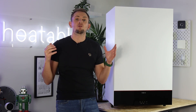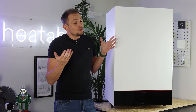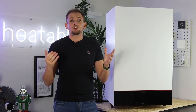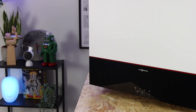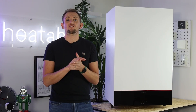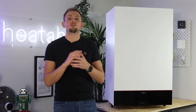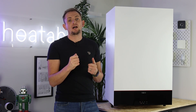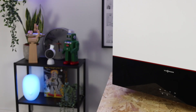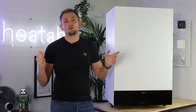There are other boilers on the market with a similar rated output in litres per minute, however that only relates to one outlet. Something like a Worcester Bosch 8000 will claim up to 16 litres per minute, but that's through one shower only. Other regular combi boilers rated at 16-17 litres per minute can only deliver that through one outlet. If you turned on a second outlet, the pressure would drop. With this product, pressure would only drop very slightly and it can still deliver hot water to two or three outlets at once.